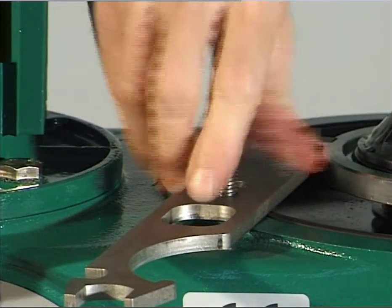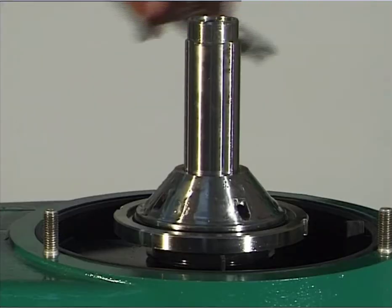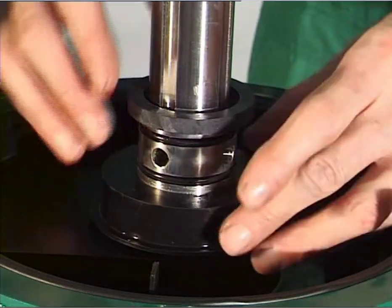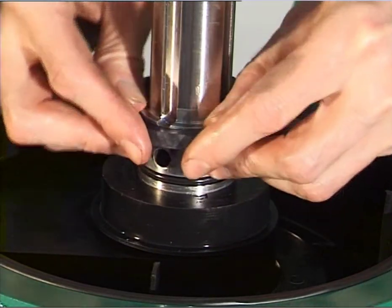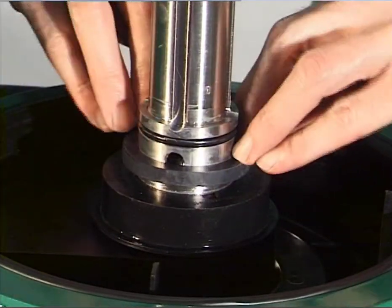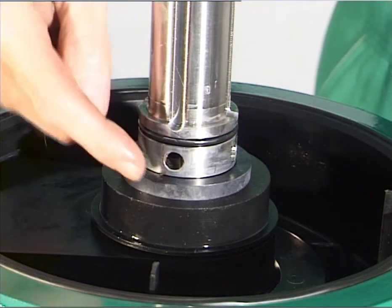Force the bottom with fitted gaskets off the spindle with the aid of two hook wrenches and remove it. Apply the two hook wrenches only to the rim of the bottom. Position the gasket on the spindle cap and press on firmly, so that no cleaning liquid can enter the drive and ruin the lube oil. Clean the gasket grooves and holes in the spindle. Remove the grease from the belt running surfaces of the spindle, the flat belt and the flat belt pulley.